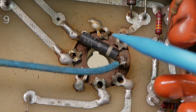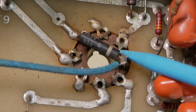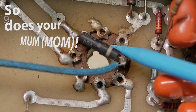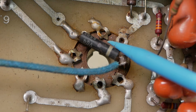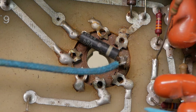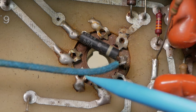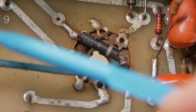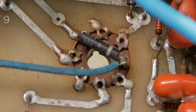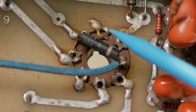The best way to stop it from occurring at all is to put these flyback diodes in place. If they do cop it when that happens, they cop it pretty hard, and they go short circuit, sort of like an anti-fuse, and that will blow the HT fuse if it's got one, or in this case, the amp's main fuse. But what it won't do is destroy your transformer's insulation, requiring replacement of the transformer, either the power or the output, or both, because they're both connected to the B+. Or damage your valves, damage your sockets, requiring a fair bit of labor to replace all that stuff. It's a lot easier to replace a $2 diode and a $1 fuse than to do all that. So it's a good little insurance policy. I wish they still kept them in.